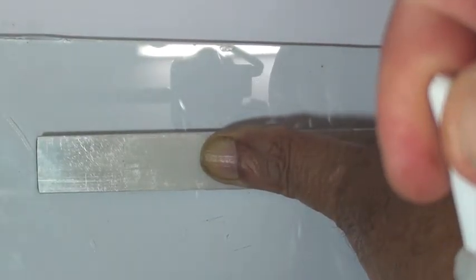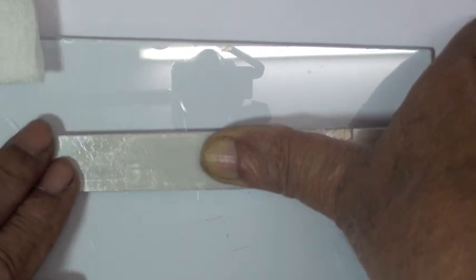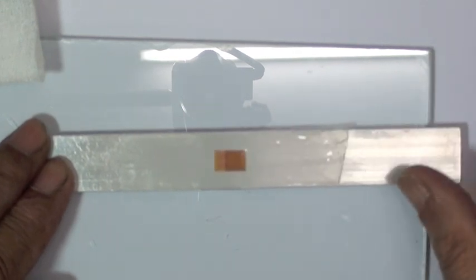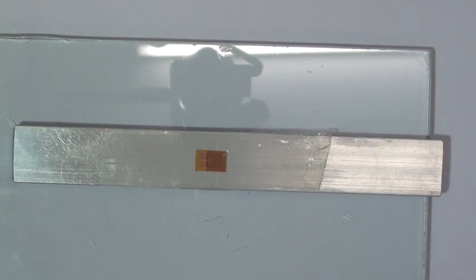And to help you out here, I'm going to put the lid back on this adhesive. You know, it's worth noting in this video that any instant curing cyanoacrylate is going to be very sensitive to humidity. Humidity will cause the adhesive to go bad in a hurry. So if you're working with it, you want to make sure that it's capped and uncapped and stored that way.